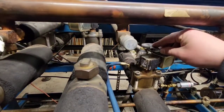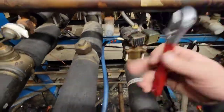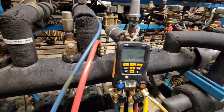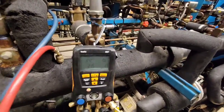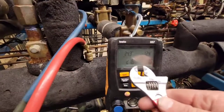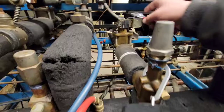Come back over here. This is 25 — I want it to be 34. I'm going to turn it just a little bit to the left, threading it out, just opening the orifice. You can see it's going down a little bit. I'm just going to keep adjusting this until I get the desired pressure. Right now we've got 24 degrees — so this is going to translate to a 34 degree case. The case is targeting 33, so the case will constantly try to pull down to temperature, which means the valve will stay open instead of slamming closed and open, preserving the life of our valve. We have a pressure difference of 20 — more than enough to know that this valve is being set.